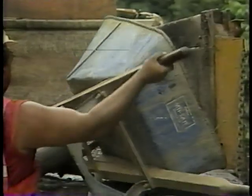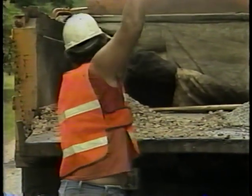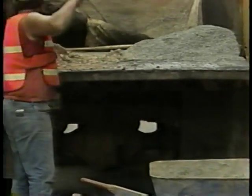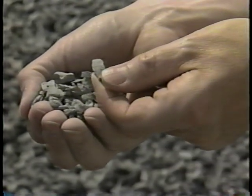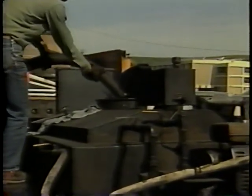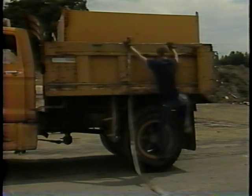The proper materials make the repair durable and long-lasting. You will need granular material to fill the hole — it must be graded and approved according to local specifications, and should be the same type and quality as the existing base. You will also need cover aggregate that is clean, dry, and no bigger than your thumbnail. Liquid asphalt to seal the patch — this may be rapid or medium-curing asphalt cutback or asphalt emulsion. And water to make sure the granular material has the correct moisture.